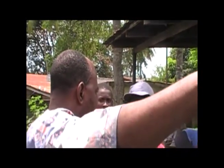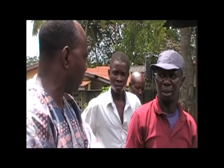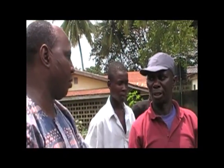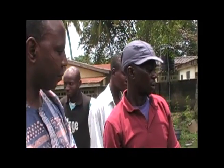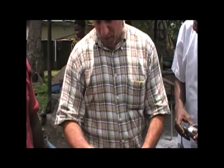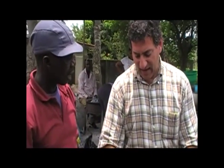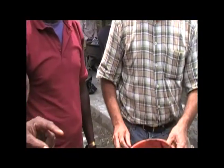So, the slurry, you can use it as fertilizer. You can collect it and use it to water your plants, your vegetables, your garden, your crops. But this is a good bucket size to think of for a digester of this size. If you were to throw in your rice and your peelings every day, if you were to fill it like this, because you would need the gas the following day.